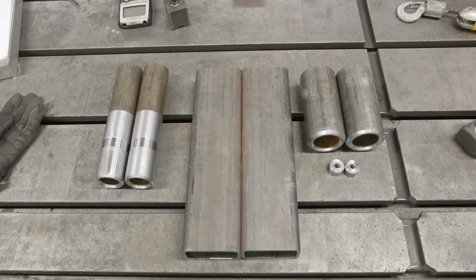We have a machinist jack under here, under the bung, and we have it firmly clamped, so rigidity shouldn't be an issue. We're running a 1.5-inch bar, I believe. And we have a brazed carbide tool. I wanted to use a carbide insert initially, but because the bore is so small, I either had to go high speed or brazed carbide just for stick out.